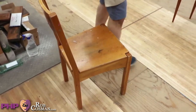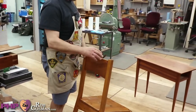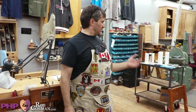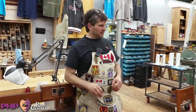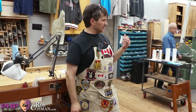In fact, a friend of mine had a dining room set that he was selling, or wanted to sell, with 8 chairs. With a bunch of men sitting on them for lunch, all of the joints have broken loose. 2 chairs have failed that have to be repaired, and it's all dowel joinery. So dowels are taboo for anywhere there's a high-stress joint. That's my opinion based on practical experience.